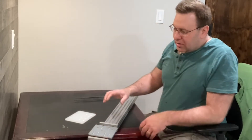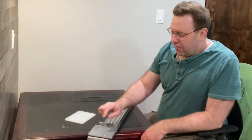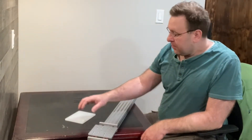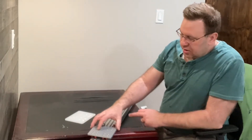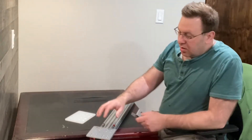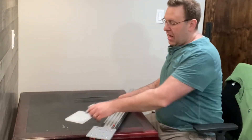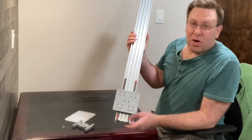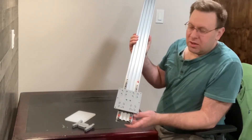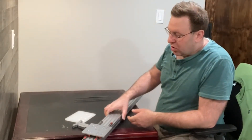I'm back inside where it's a bit warmer, and I can work on the new z-axis of the CNC. What I did is I 3D printed some parts that I designed in my 3D CAD software for the new plates for the z-axis. This one here is using the MGN12 linear blocks and rails, so it slides pretty well. I did add some different holes here just in case I wanted to upgrade to the MGN15 linear blocks — it's not necessary but I wasn't sure how the 12s would work.